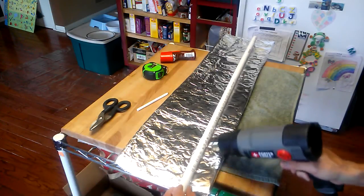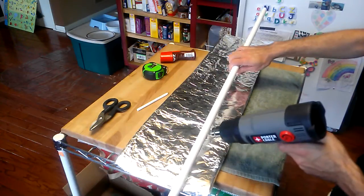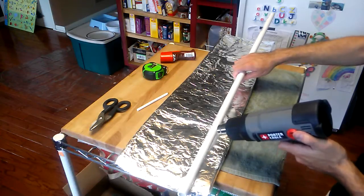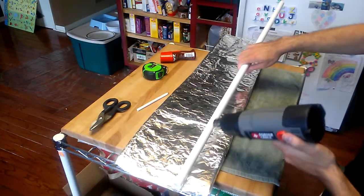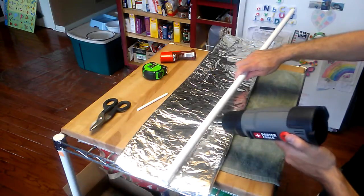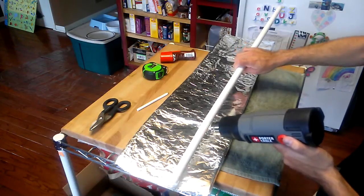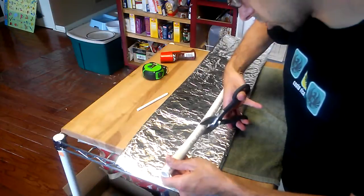So we're heating the middle. You're going to want to heat a little bit beyond these areas — not too much, just so you can get some purchase with your cutter. If you're going to saw it, that's probably the easiest. If you put it in a miter block, that's fine. But you want it to go between the 5½ and 7¾ inch marks, because these are going to be the angled back parts that mate together in the back. So let's try it right now.